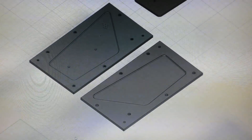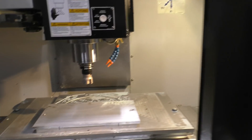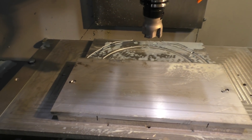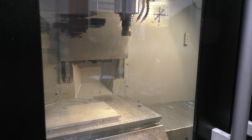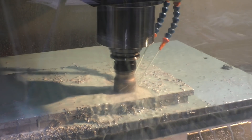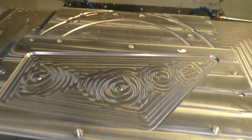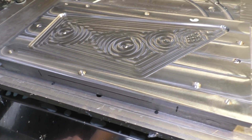After loading the G-code in the machine, I've also put the plate in place — the thing I'm going to be cutting to make one side of the mold for the end plate. It's 6061 aluminum and there are going to be four different tools required to cut it. First I'm going to do a facing operation, then all the other tools. Here's a look at one side of the mold after it's done. Now what I need to do is take this out, put the other side of the mold in — which is basically going to be a mirror image of this one — and then they'll be ready to use.